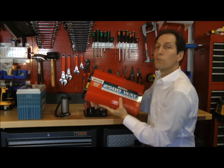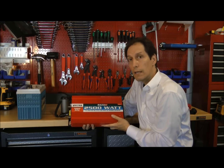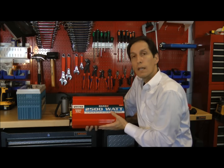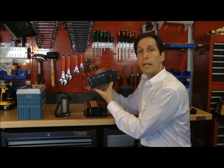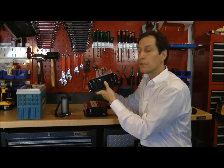Finally, I've set out a larger inverter. This one is a 2,500 watt inverter, also by Vectormax. What's important about this unit is that it also has a 5,000 watt peak rating for surge currents. Anything with an electrical motor tends to draw a lot of current when it first powers up — a good example might be a refrigerator or a washing machine. These units are meant to provide power to those heavier loads, so this is an excellent option for home use. The input side has larger connections for the battery, and on the output side there are three AC outlets, useful for distributing power to lights, a refrigerator, and a microwave.